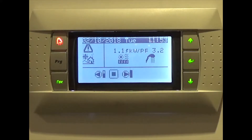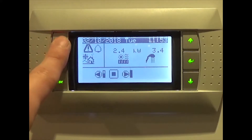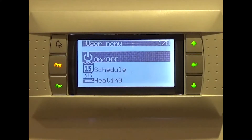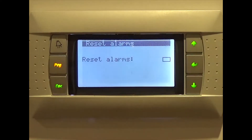To check and clear alarms, press the picture of the bell on the top left hand side of your controller. If for whatever reason this does not work, you can also access the alarms by pressing the PRG button. Then press the up arrow once before pressing enter.